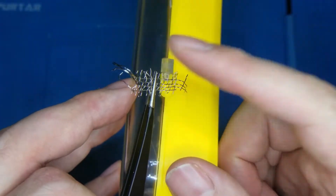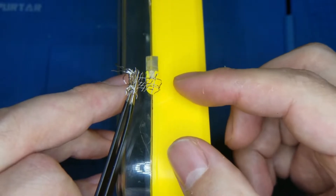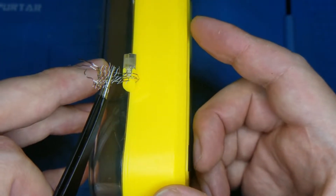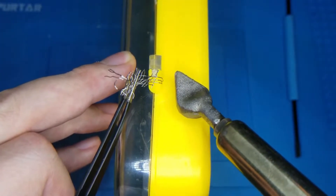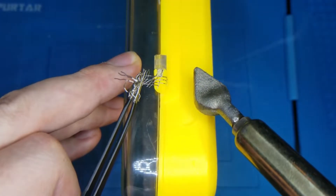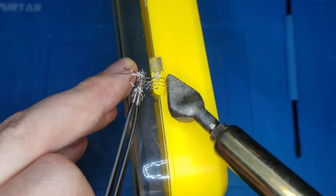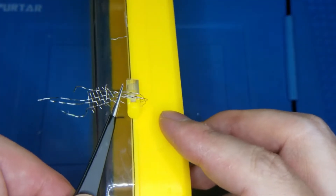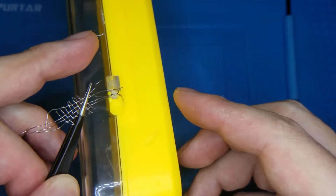We care most about the strength in this direction. Let's see if we can embed it right there. I'll remove those loose pieces. The temperature is set up for ABS. Just like that — it's already embedded a little bit. Let me reposition — we actually need to go around the break, over there, like so.